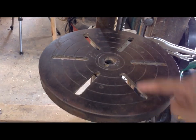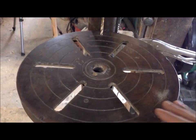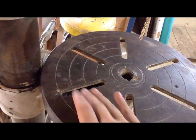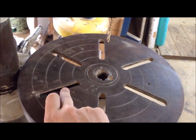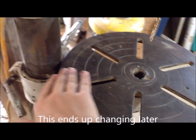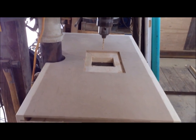Since I don't have parallel slots, I'm going to cut my losses and drill my T-track going right through the center of these two holes, so it will be stationary in one spot. If I ever need to move it, I could transfer that T-track and the same mechanism to the front holes — that will bypass my column and I could slide it back and forth. This will be my normal everyday position.